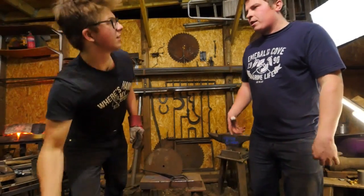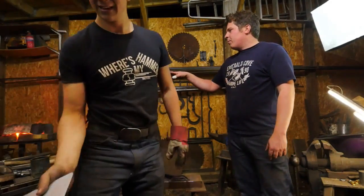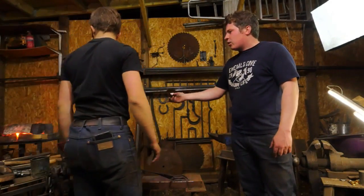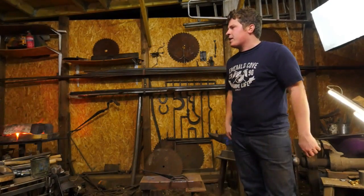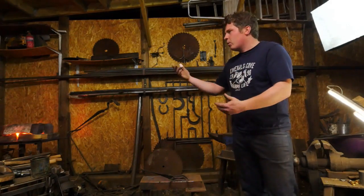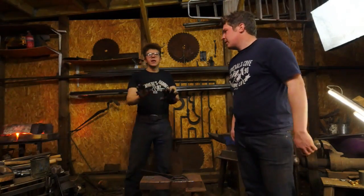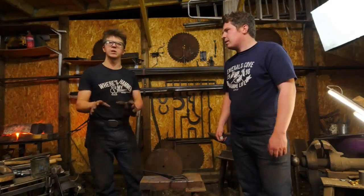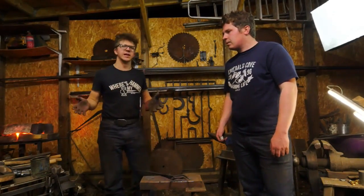People are asking what pressure the forge is running at. It's kind of irrelevant. Pressure means nothing. With this new burner, it's got an adjustable choke to adjust the air ratio, and we can adjust the pressure at the bottle as well. But okay, if you're curious about the pressure, I'm running at 20 pounds per square inch, 1¼ bar. Pressure doesn't mean anything though.